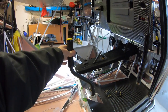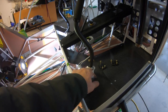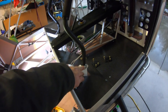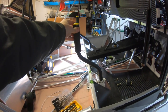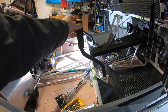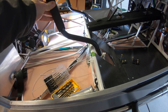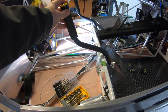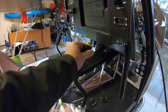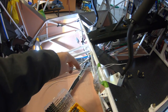The push-to-talk buttons are in, the grips are installed. I drilled the hole to permanently mount the control sticks in. What I did there is I shortened the bottom end just a little bit to give me better clearance of the grip to the panel and also to lower the grip down into my lap a little bit better. The sticks when they come from the factory — you don't have to use that length, you can shorten them to your liking as long as when you pull full back it clears the seat and the bar. The cushion has a recess in it on mine so that will be fine at full aft. I didn't connect the wires on the co-pilot side just yet because I don't have a two-pin Deutsch connector.